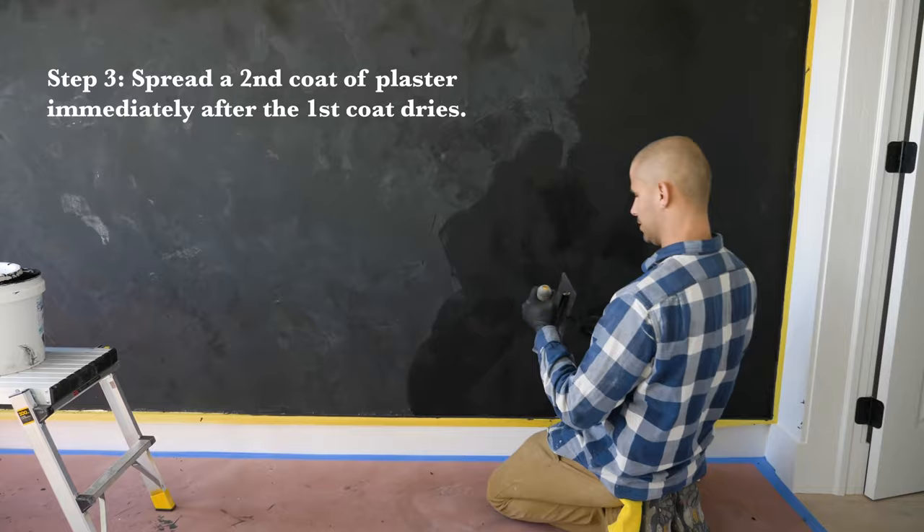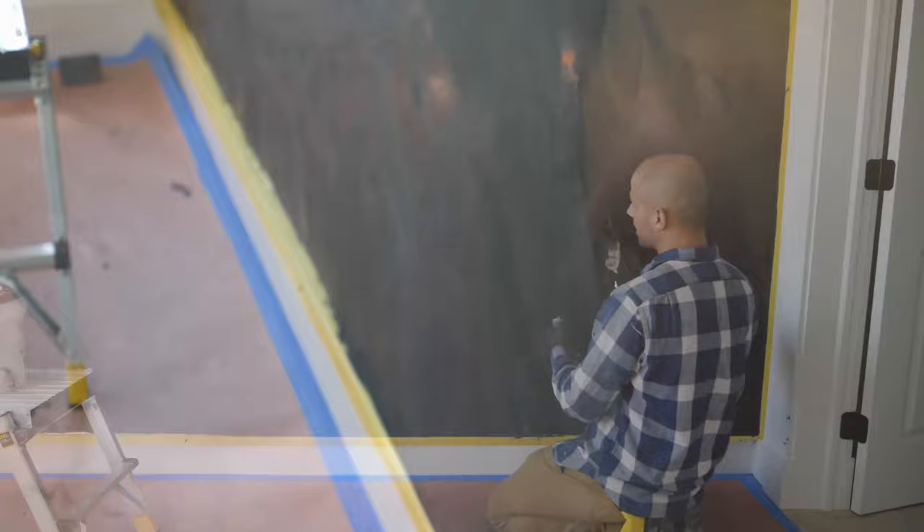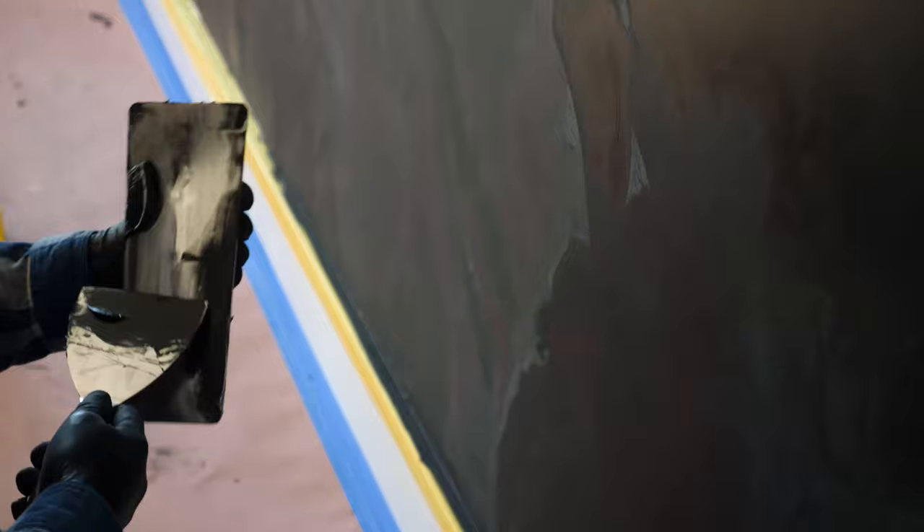So this is the second coat, and the hardest part of applying this material on the wall is letting it go, because if you apply too much it will be too thick. It will take forever to dry and then you're going to have to wait longer to burnish it. So once you do a stroke or two overlapping, you want to just keep going. You don't want to go back because it's halfway dry and it may start peeling.